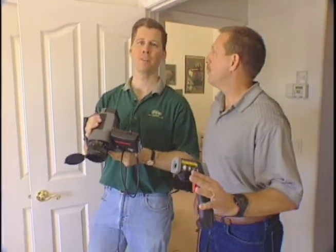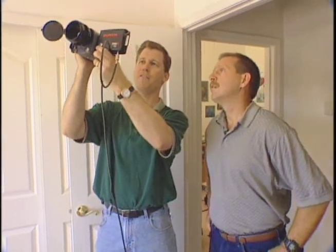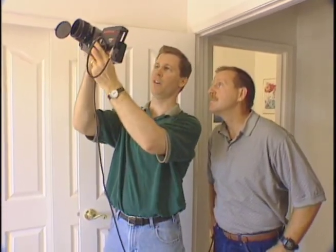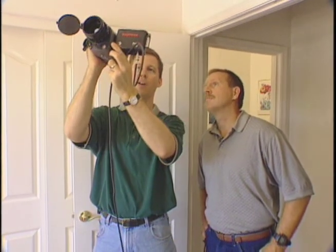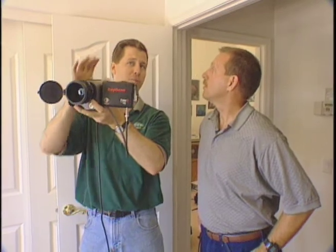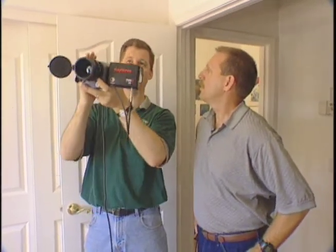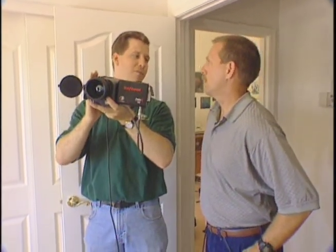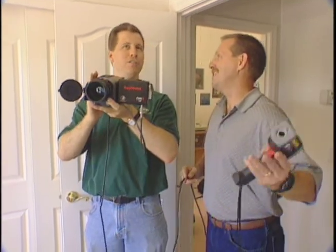Over in the bedroom, there's a spot where a piece of insulation is actually missing — that entire cavity is missing — and we've got a couple of small problem areas over the window. Back over here we have blowback occurring. Blowback is when the loose-fill insulation is blown back around the perimeter of the house because of ventilation holes. That's a problem we see all the time, and it's as easy as putting in baffles during construction to fix it. You can put baffles in afterwards too, though sometimes those hard-to-reach areas make it difficult.